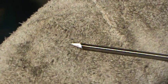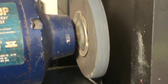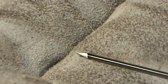This is a 3/32nd electrode. This rod right here is 1/16th. Some people use the larger rods and get them to the point — they sharpen them all the way down and use one electrode — but it's better to use the correct electrode for what you're using. Smaller electrode for a smaller amperage.